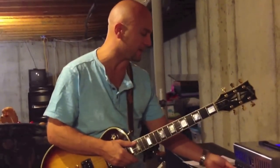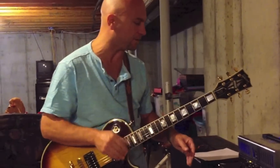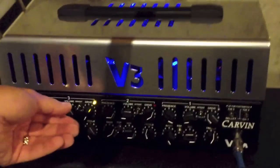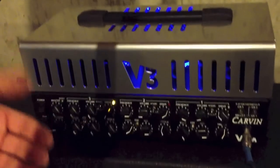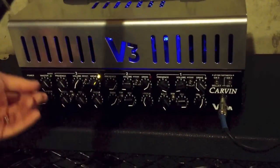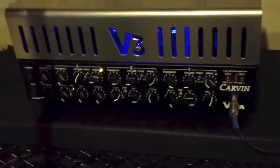That's why I recommend keeping the master high — keep it on ten. When you first set up the amp, keep it on ten. Get a good voicing and then you can always bring it down from there. Otherwise, you're going to introduce unwanted compression and unwanted distortion, which is going to affect your tone. Any distortion is going to add beef and meatiness to your tone. So that's the master volume thing — keep it open. You can always add it for effect later, but get your basic tonality that way.